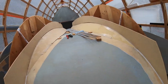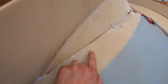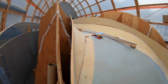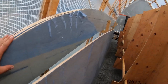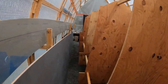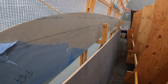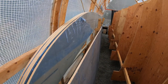The front of this is all tacked up now and everything's looking pretty good. I do have to pry this up just a little bit and put some more epoxy in here tonight. We're going to try to do the hull bottom panels — the two that make the V on the front. They're sitting in the rack still, so we'll peel the peel ply off, throw them up on the forms, and see how they fit. I'll probably try to glue the flat seam with resin, let that set up overnight, and then try to curve them down a little better as we go.